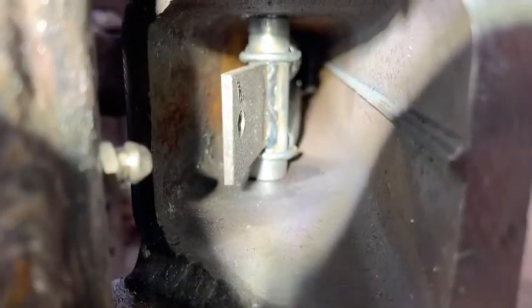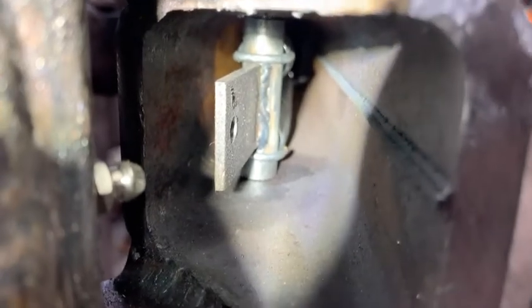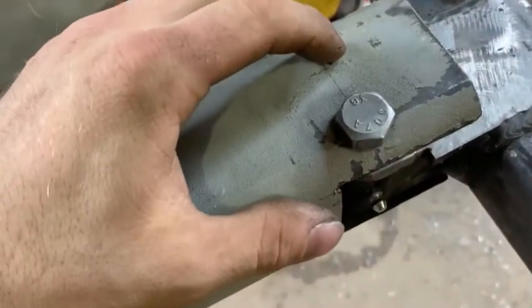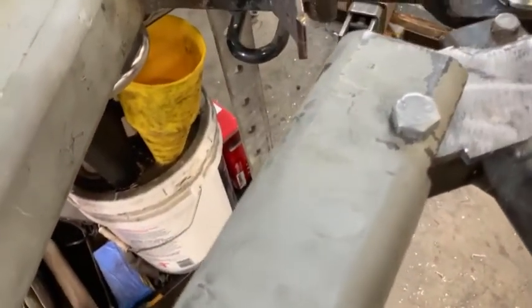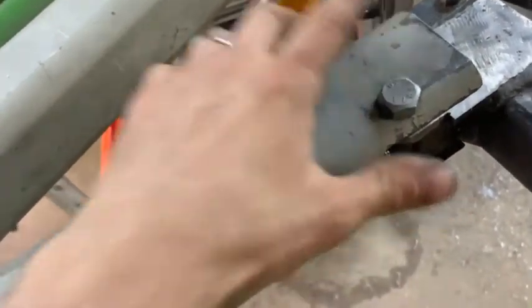You can see there are two springs in there — those are trampoline springs. They fit on that shaft right there, which is on that bolt. The springs come up to here, and there's a pivot point on the back of this — almost like a little bitty hinge. The springs are hooked to the hinge, so as it rotates, that hinge stays straight with the springs and always pulls tension towards the back of that bolt to keep it sprung.